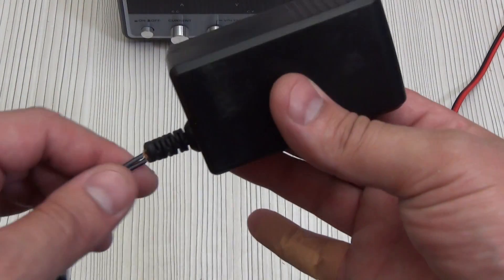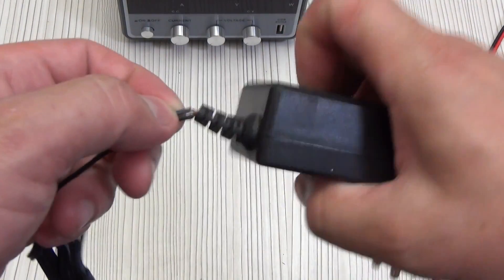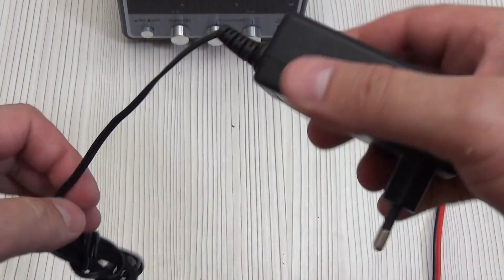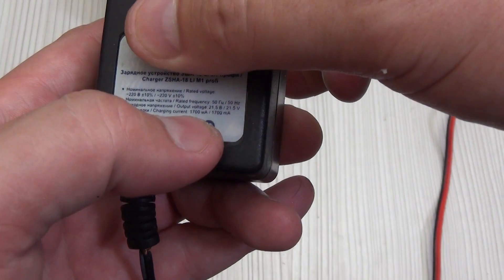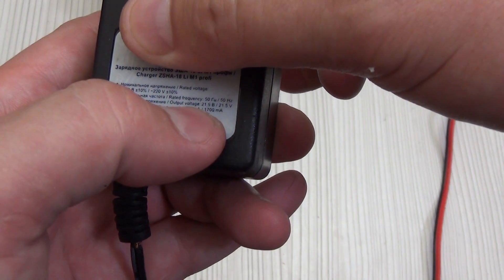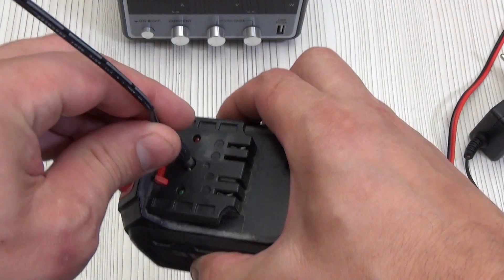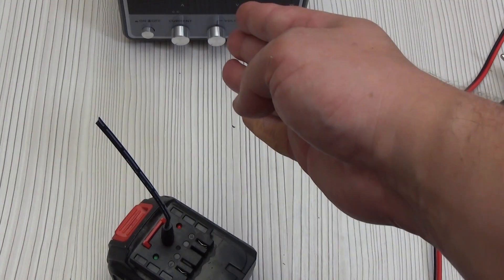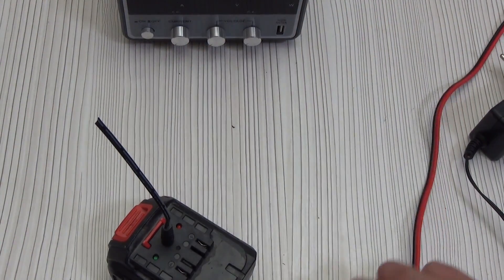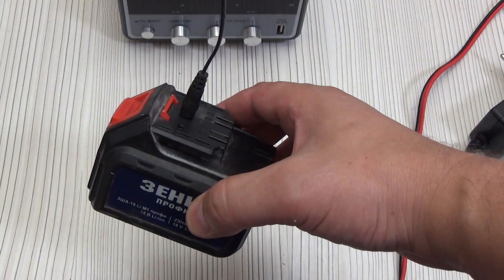The following cases are life-related. This is what the power supply of my screwdriver looks like — what happened is a programmed failure: it simply shorts out and will not charge the battery. We check that it gives 1.7 amperes and 21.5 volts. We take the battery, disconnect the connector — we need to work urgently. Without mixing up the plus and minus, we preset 21.7 volts and then adjust the current. After the full charge, the current will drop to zero and the battery will be charged.